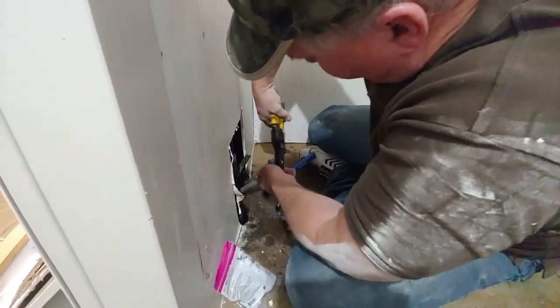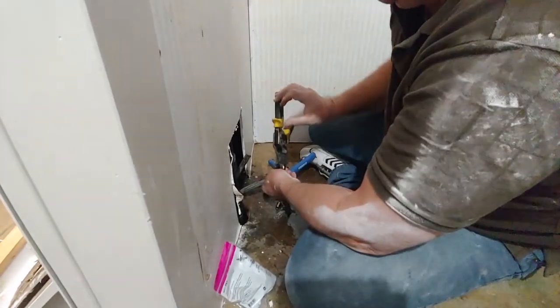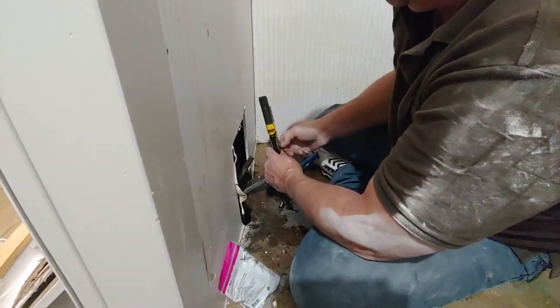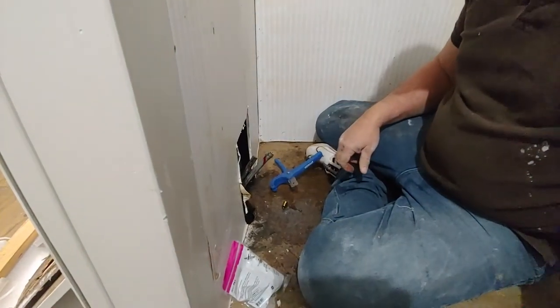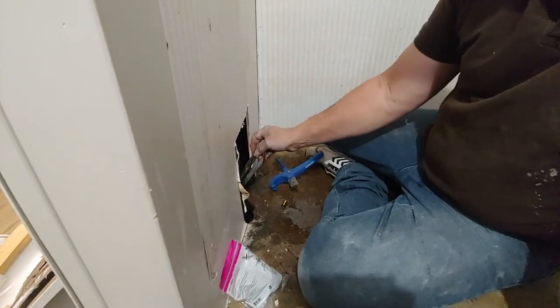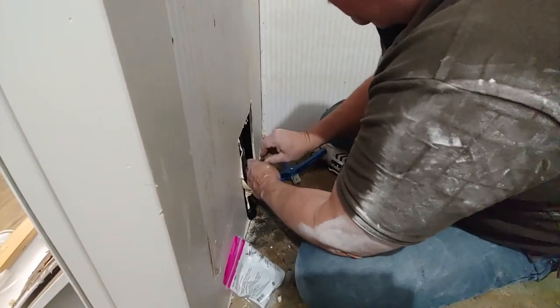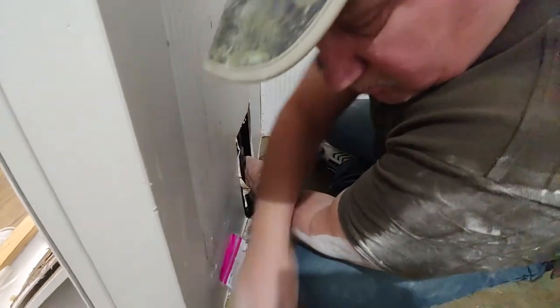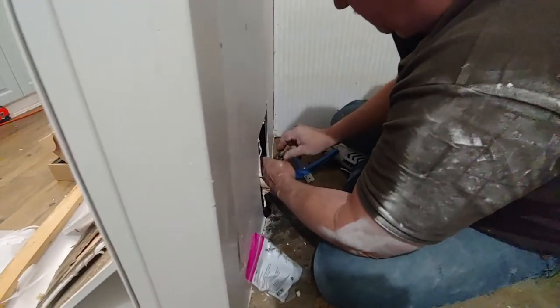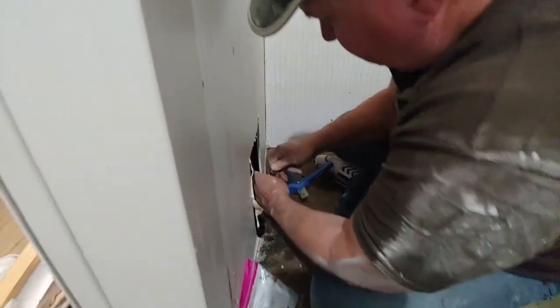And you want to make sure when you drain your water that you run a hose, and that you turn the electricity off if you have an electric water heater, because otherwise you'll burn the top element. And then you don't have a hot water heater. You have warm, barely warm water. You'd be missing hot water. Yeah, you'd be like, oh, I know what hot water used to be like.